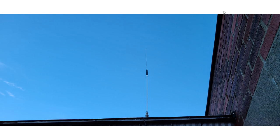What happens with a lot of portable scanner radios is that an outdoor antenna, especially in a big city, is overloading the radio too much, and it actually has a reverse effect. When a radio is overloaded, it actually desensitizes — the signals are actually weaker than when you had a regular rubber duck antenna, because the circuits can't cope with those strong signals around you.